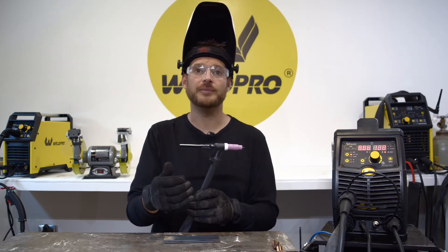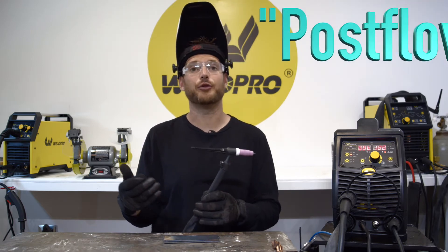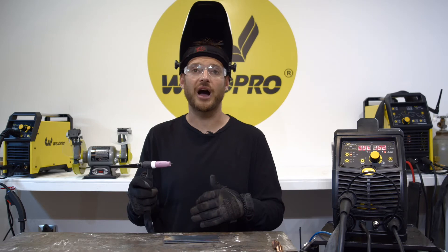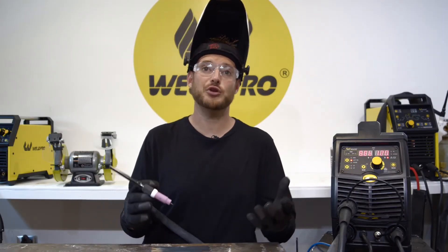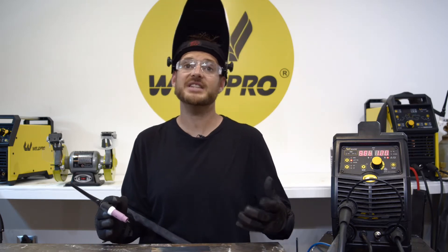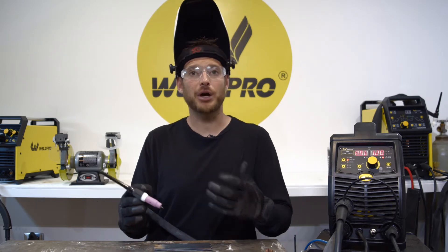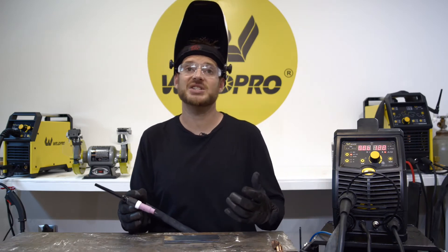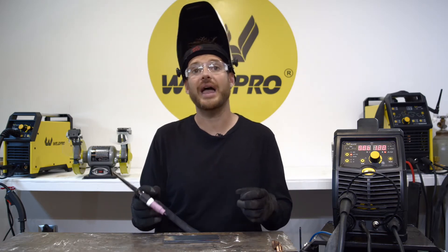When we're done welding, we're going to leave that gas valve on for a few extra seconds, then use our fingers to turn it off. For this first weld, I'm going to perform what's known as a fusion or autogenous weld — I'm not going to add any filler material. I'm simply going to allow a puddle to develop, see if I like it, and make any amperage changes as necessary until I have a good grip on my travel speed, torch angle, and overall weld pool size.